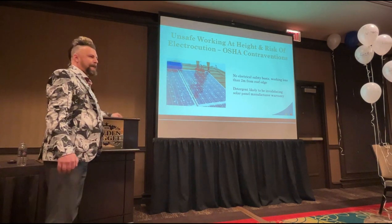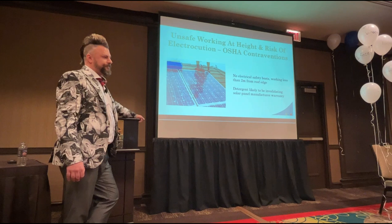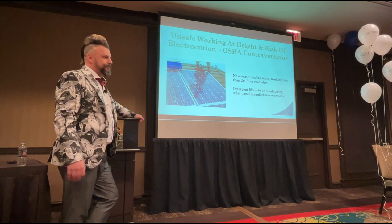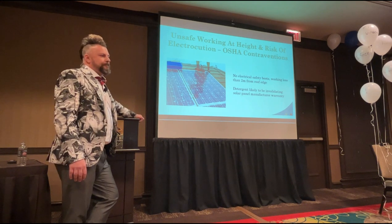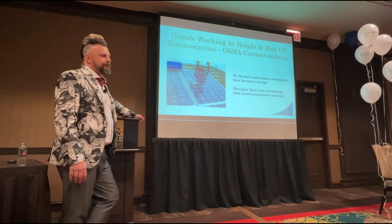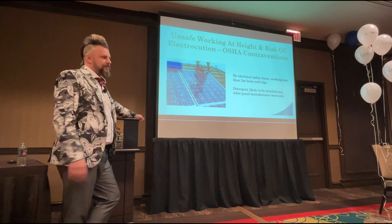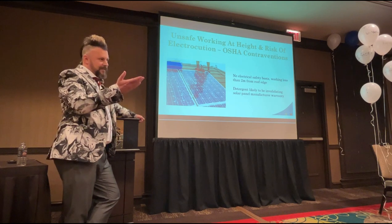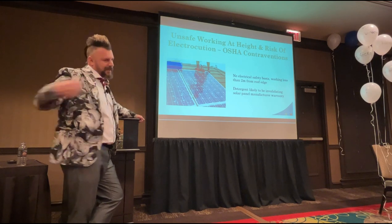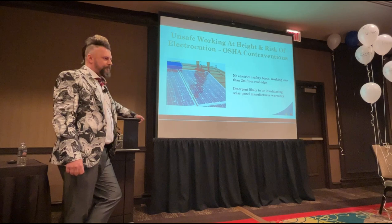The 2 meters from the roof edge, this is not for a slope roof, that's for a flat roof. Any roof work, any edge. Right, but I thought it's more strict on a slope roof. 2 meters is 2 meters. An edge is an edge. If it's flat or if it's an inclination, you're going to fall. Right, but I thought on a slope roof you need more than 2 meters because you're sloped. Not from what I've read. I'm happy to be corrected, but from what I've read on the OSHA guidance, it's 2 meters. Okay, I'll double check. Obviously, there are caveats with that. If you're going onto a slope roof, you need to think about, do I need to be attached to something anyway? But then if you're attached, the 2 meters goes away either way.